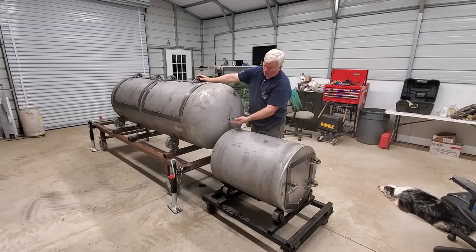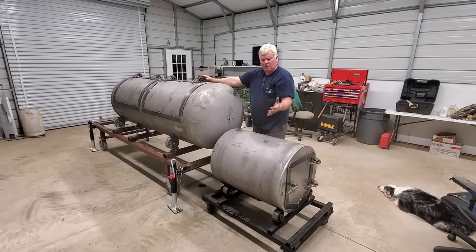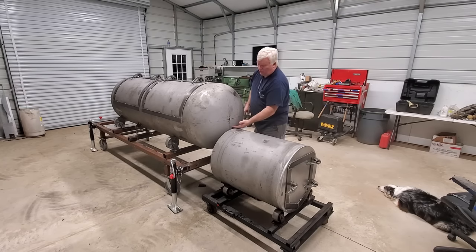If we come up too close to that grate, we really increase the size of that hot area. If we go down too far, that hot area gets smaller, but then we start having other trade-offs like ground clearance. If we have it on casters or rollers or golf cart wheels or whatever, on some sort of cart, then the firebox is going to be sitting lower. If we have it on a trailer, that could be really problematic if your firebox is sitting too low, because then you're dragging. There's really no way to get this thing down far enough to get a long way away from that grate